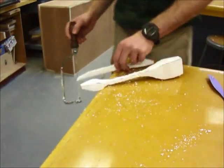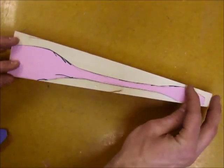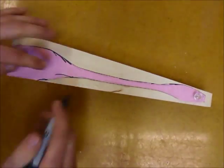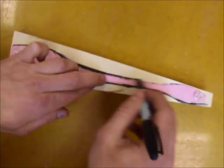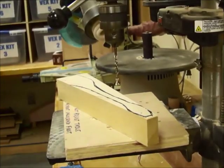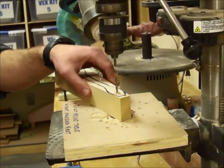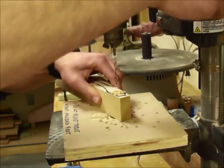When you've finished your foam model and your instructor is giving you the go-ahead, you can start the wooden car. You'll take your same paper profiles and trace them onto the wooden block. Again, make sure the axle holes get drilled before you cut the profiles out — this will make sure that the wheels spin straight forward like they should.